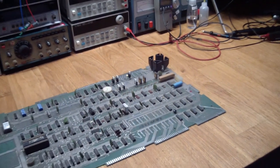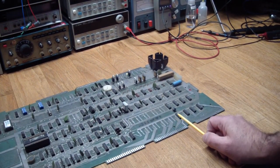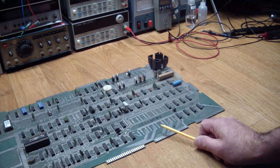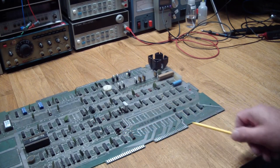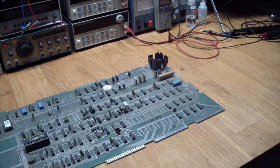Even after that preventive work, this board does not work right now. I put it in a machine and the display was flickering, the light bulbs were all on at full intensity — which shouldn't happen, because even if the lights are stuck on, they shouldn't be that bright. So we have a non-working board. Let's start going over it and see what we can find.